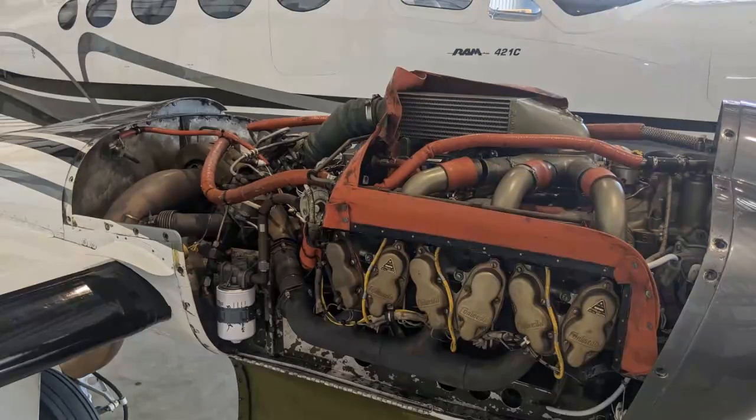Basic troubleshooting starts with getting information from the aircraft owners: what was the airplane doing? They had no problems with the initial run-up — RPMs were fine. But on occasion, after flying for a few minutes, they would start misfiring. The engine RPM would bounce, which means the airplane was firing when it's not supposed to. He shut off the magneto, everything ran smoothly on one magneto, then landed and gave me a call.